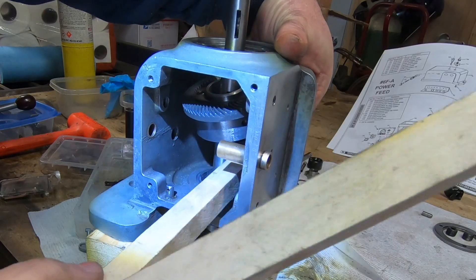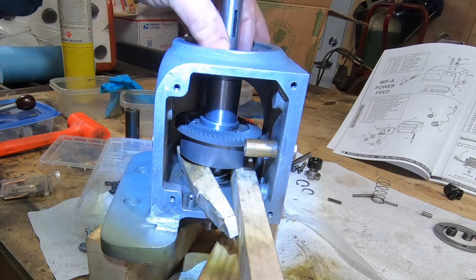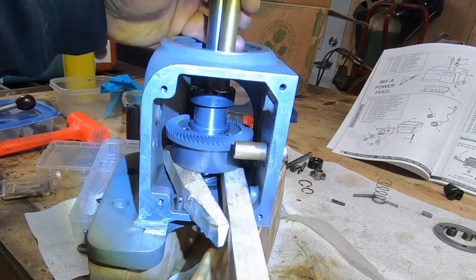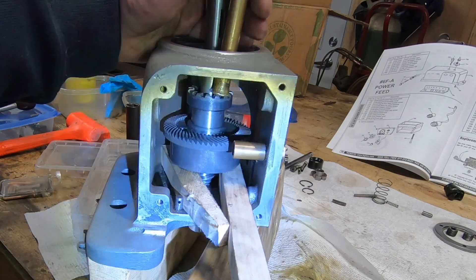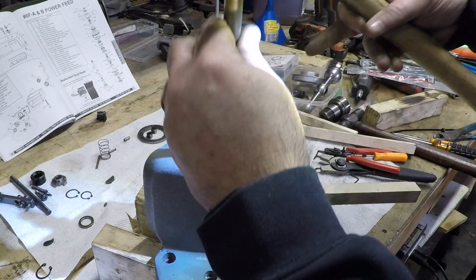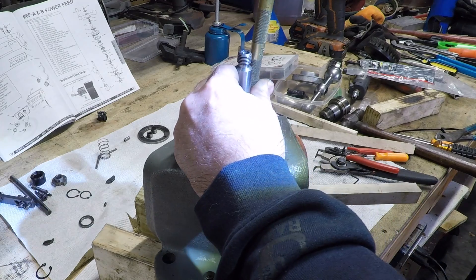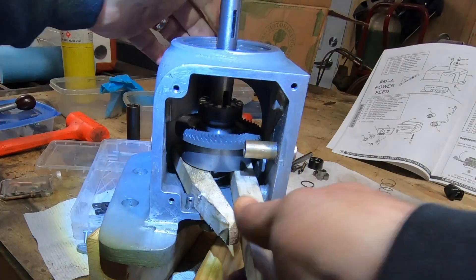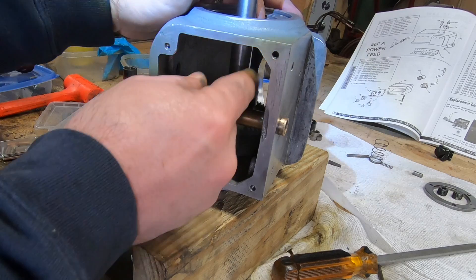Because I did not include the driving clutch in the assembly when I put the shaft back in, I now have to put it in with the hub in situ. So I raised up the hub with some scraps of wood and then dropped the driving clutch on there — it's a bit of a press fit, so I drove it home with a brass punch. I do fully appreciate that there's likely a way better way to do all of this, maybe with a hydraulic press or an arbor press, but unfortunately I don't have any of those.